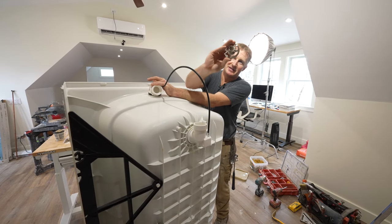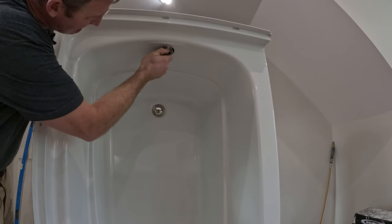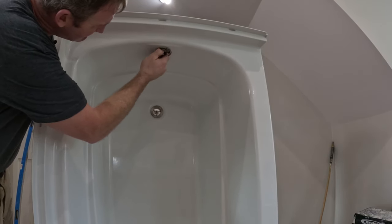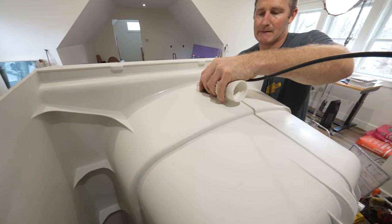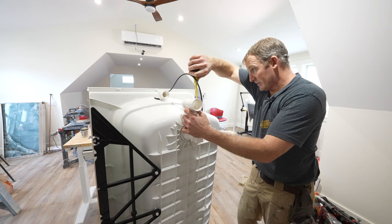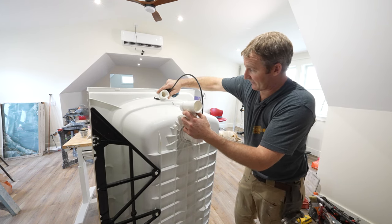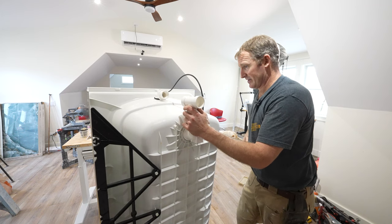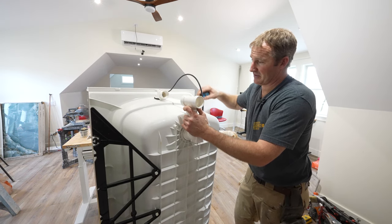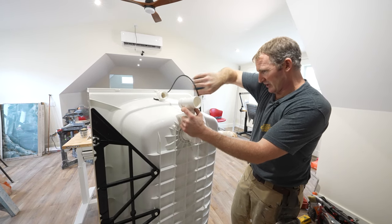This just has a little locking sleeve on here. You just need to cut the bottom piece first — this is flexible so it gives you a lot of ability to move it around. You just don't want to go past the flange or you're going to run into an issue with the floor. On this tub we're going to go about three and a quarter inches, so we'll cut a piece of pipe. I highly recommend you use a chop saw for this so you can be accurate.